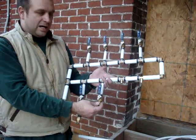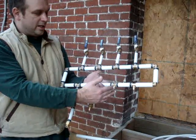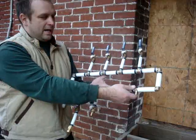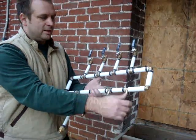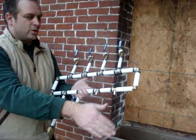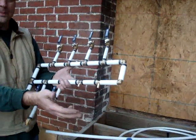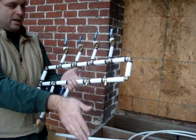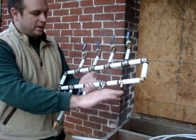This port is going to go to the outside front spigot, this port is going to go to the outside rear spigot, and this port is extra. I'll have a shutoff valve on it with a plug, and if I ever needed to add another cold water circuit — like if I wanted to put a slop sink down in the basement — I would have it here. This will just go to a shutoff valve, go to a plug, and be done.